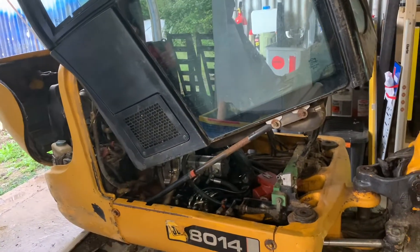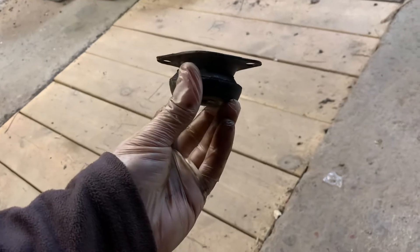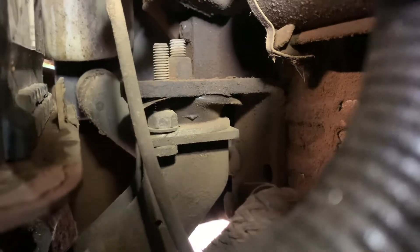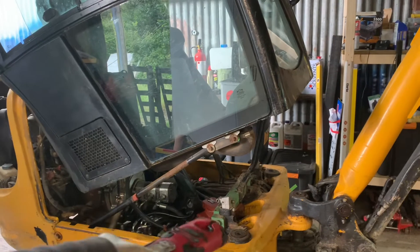Because I can't do the engine mounts — that's beyond me — let's have a look at one of them. This is the rear engine mount, that's what it should look like. So comparing that one to the one that's in there... yeah, it definitely looks a bit squidgy. So until I can get the engine mounts replaced on the back, I'm going to put a shim in there.